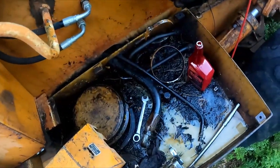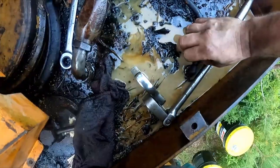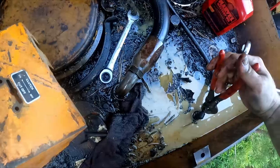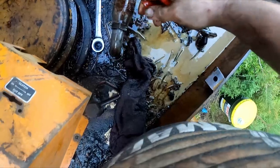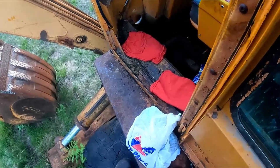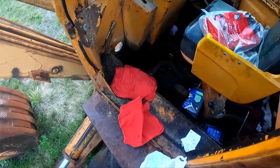What a pain. All right. So now I think if I connect this up, one thing with these JIC fittings, you do not have to murder them tight. Like just a light grab is almost enough. That's about it. Just a good tightness. Okay. Look around the other side, recompose myself, and hopefully we'll move some controls today. And not spray any more hydraulic oil everywhere, but probably. Oh yeah, it's going everywhere.